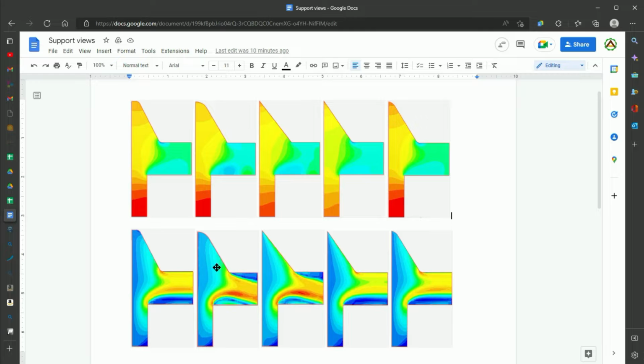The second interesting thing to note from these velocity magnitude maps is that when you had the curves at the top, you had a more uniform velocity profile as you went in the X direction, while once you got rid of that curve at the top and just did a sharp point, it's more of a triangular shape, as it has to speed up much faster. It doesn't have that grace period as the curve generates into this bottom slope here. It goes straight into the bottom slope, and so it has to speed up a fair bit faster.